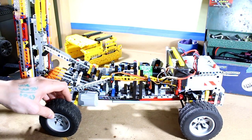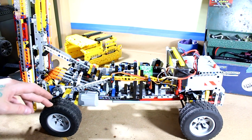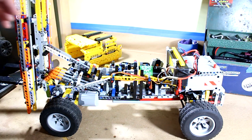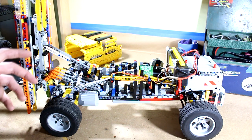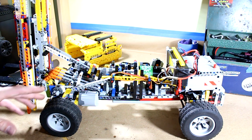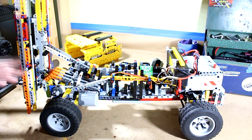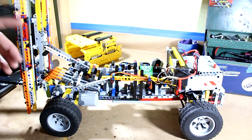The one thing I didn't use in this are Lego pneumatics — Lego does make pneumatic cylinders that are air powered, with little pumps and compressor tanks. I didn't use any of that. My reason for not doing that was because of the strains I knew this was going to be under — it needed to be all mechanical. All the movements needed to be done mechanically with gears, not via air, because the little cylinders aren't good for something that really needs to hold up to a lot of strain.